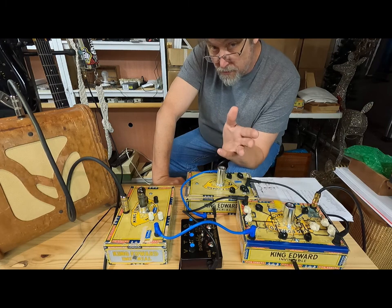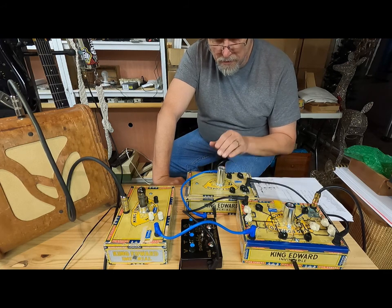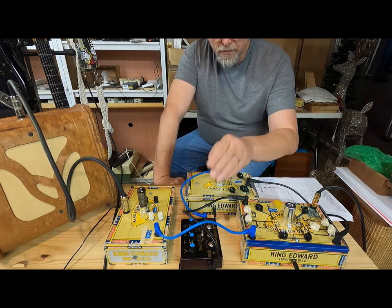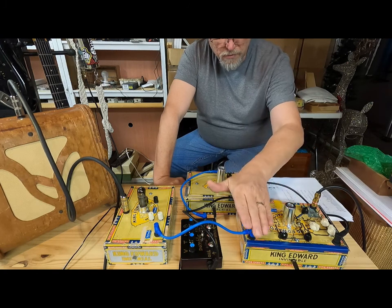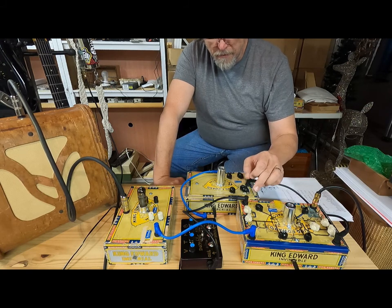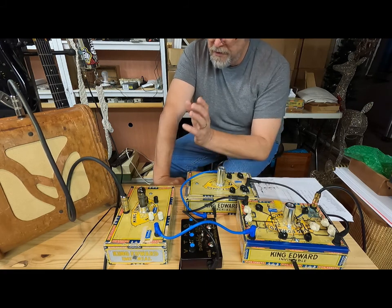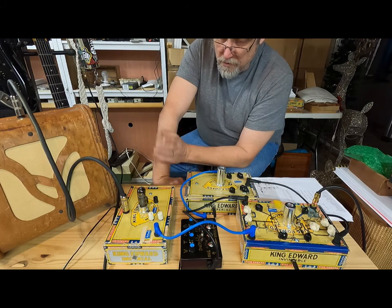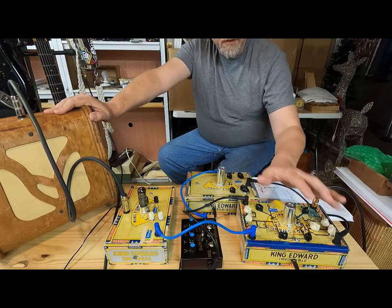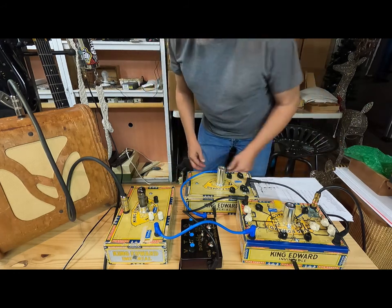Yeah, there's a video elsewhere on YouTube where Jackson steps through essentially what he did. He created a cathode follower that went into the tone stack, and then he used the second gain stage to make up the volume part only. So this is very, very approximate. Same EL84 stage. JCM800 doesn't use an EL84, so this is really just to give it some audible sound. But the first and second stage and the cathode follower should be pretty close. Hope it doesn't blow it.